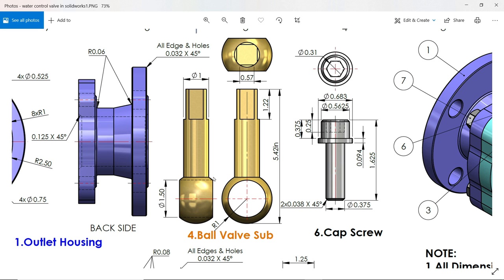Now here the next part is ball valve sub. The overall length is 5.42 inch. This outer radius, this is a sphere, R1 radius. Then there is a hole, 1.5 diameter. Then at the top, we have to cut a square shape like this, 0.57 this width, 4 number of instances, depth 1.5. So let's make this